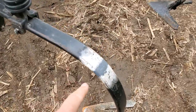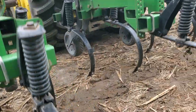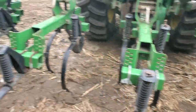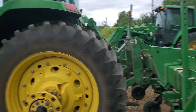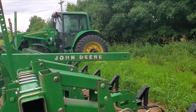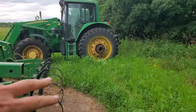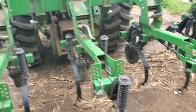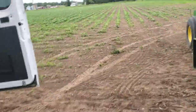You can see right here — I just heated that and then whacked it and got this, so at least it's flat, parallel to the ground. I've done that a couple times before, like on this shank right here and this shank here. My understanding of spring steel is if you get it too hot you'll lose the temper — you're supposed to get it super hot, cherry red, then quench it, and then temper it to bring it up to a certain hardness. If you don't do that, apparently it'll just revert to mild steel and bend. But those other two repairs have held up for 500 acres without bending again, so I'm going to try it again on this one.